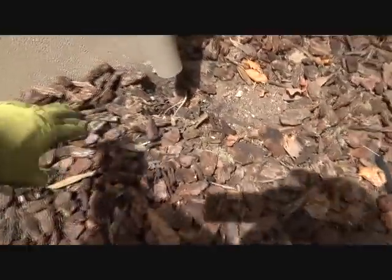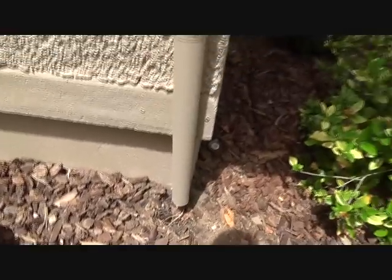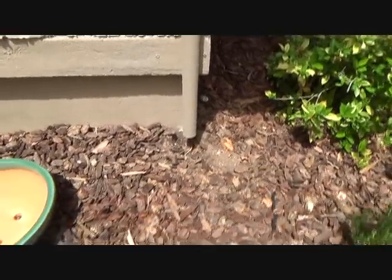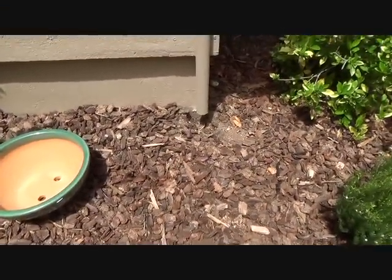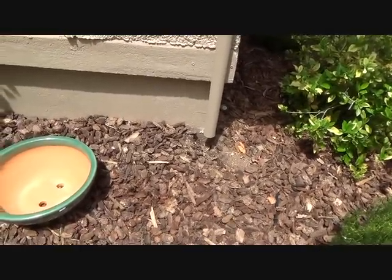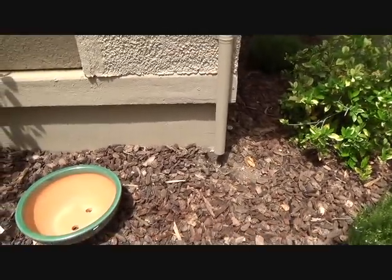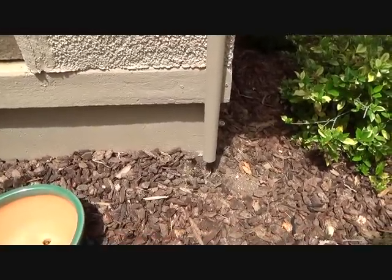See how this downspout, we didn't have a return on it, and it's just straight. It's already plowed a hole, nice little hole right down in the ground right there. And that's what's going to happen if you leave a downspout like that. So always do something, you know, put an elbow on there, put a flat channel piece down there, and get that rain off of your footing because it could do some damage.